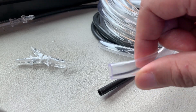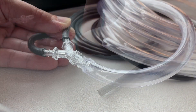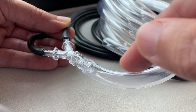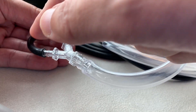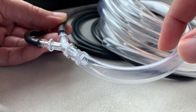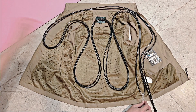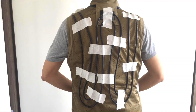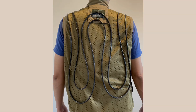To transition from the 8mm to the 4mm tube, I'm using a Y splitter. The 8mm inner diameter hose connects here and splits the water into two 4mm tubes. One side is the inlet carrying cold water from the chiller to the vest, and another identical set serves as the outlet. In this shot you can see the draft layout of the rubber tubing on the vest, and I'm taping the tubing to hold it in place before finally sewing it to the vest.